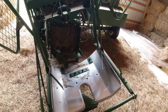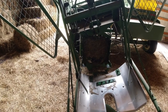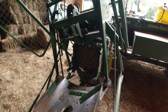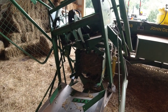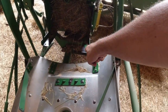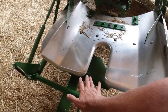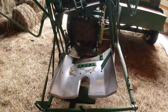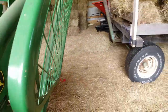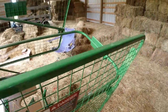But when you're in a rush to get done, let's say the dew's coming or maybe some rain's coming, and this is a high-capacity baler, this John Deere 348, and you start jamming hay through it, the next bale, when it kicks, will almost shoot the bale off of those ramps over top of this, and it'll lay on there. And so what happens is, when it goes to kick the bale,